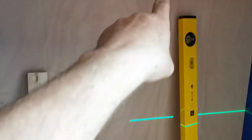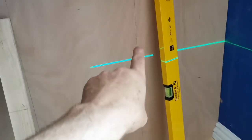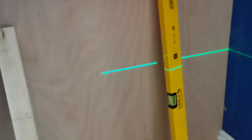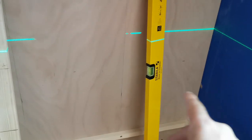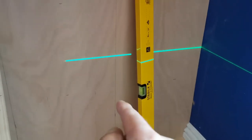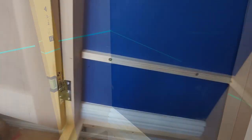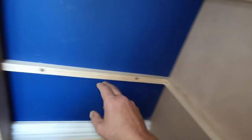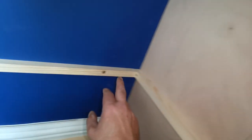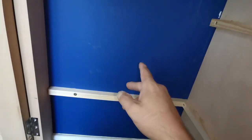I put these studs at one foot and I've already screwed into the bottom there. Because I put them in at one foot and levelled them, plumbed them — all I had to do was measure in a foot, put a plumb line, and because they're two-inch thick I'll be within a cat's whisker. Lots of battens, lots of screws. I'm just screwing these battens on, and I realised I've got these ones on the wrong way — just as well I caught them.